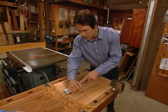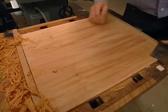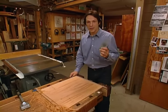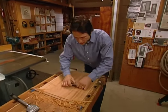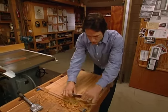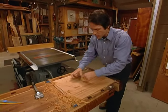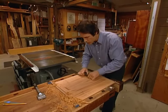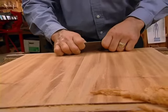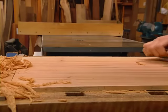We're just finishing up removing the glue from the center line of our panel. Now we'll come back with a handheld scraper — this is a great little invention. This simple piece of steel removes a lot of material quickly, much like a hand plane, but without the risk of chipping out. By using the scraper and holding it at a slight angle, making some smooth strokes with the direction of the grain, we can really remove mill marks rapidly and bring out the clarity and figure of the wood.